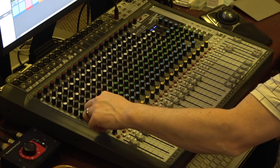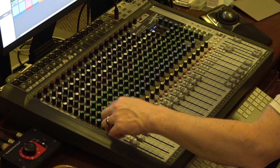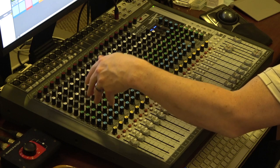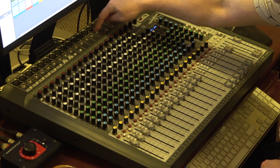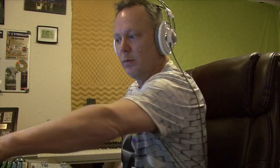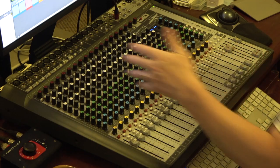Once that's set up, you'll see your EQs — a nice four-band EQ. These three knobs are for auxiliary sends, and then you have effects auxiliary sends, so you've got five auxes and two effects. These allow you to route audio out via TRS into outboard gear, then route back into any one of these channels. You can even route back into a channel with the DBX limiter on.